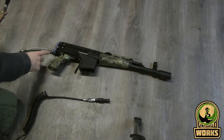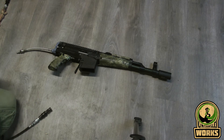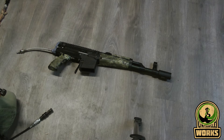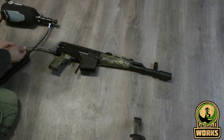What I forgot to mention is that this piece is printed without any air gaps inside — it's solid, as of course needed when you do something like this. I will use this air tank. This is a 200 bar air tank, which will be 3000 psi. But the output of the regulator is lower — it should be around 700 psi, but it differs from regulator to regulator.